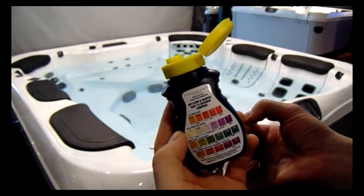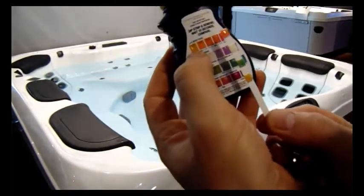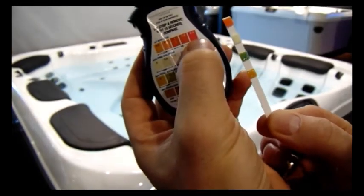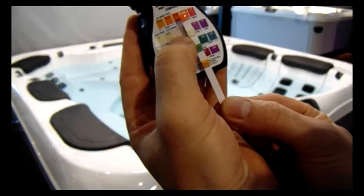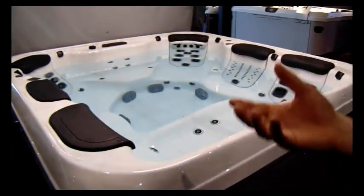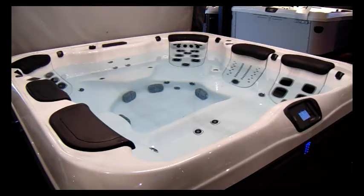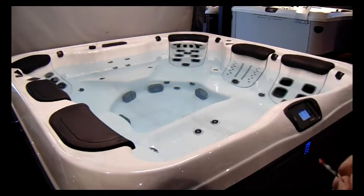Once we've done all these chemicals and everything is fine, you're then ready to start using the spa. What we're checking now — it's not low pH, it's not a high ready pink like it was. It is now sitting at about 7.4 to 7.6, which we're very happy about. Going forward, if you've just filled your spa with brand new water and done this whole process, we want to add two teaspoons of spa chlorine at this point to make sure any bacteria that has been growing in the plumbing is killed. Add two teaspoons of spa chlor to the water and then you're good to go. Well done.